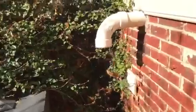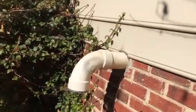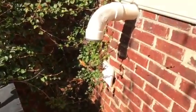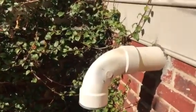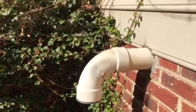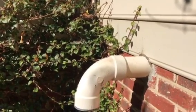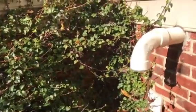Okay, just at the moment I have jumped out the vacuum switch and got it started in order to get them some heat. The house is really cold, so I'm just going to let it heat up while I'm investigating here. And looking at the flue pipe, it's pretty long. It has also got a few elbows in it. It's got more 2-inch fittings than I'm comfortable with. You can run a couple of 2-inch fittings in a short piece of pipe and then go straight to 3 on a furnace this size.